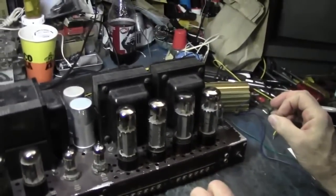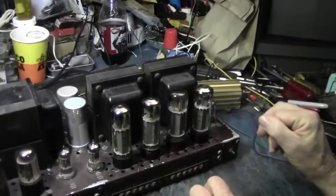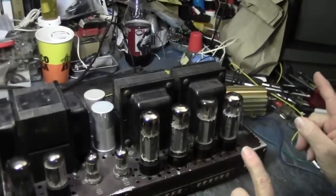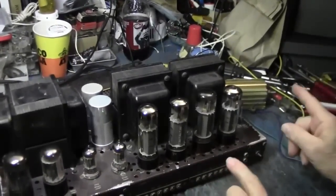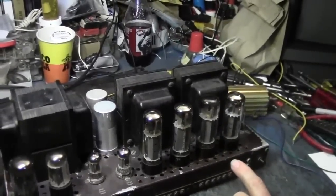Okay, now let's say the simple stuff. What class amplifier is this? It's class B. Okay. Yeah. It does have a cathode resistor, which most class Bs do not. They're cathode straight to ground. But this one has a damping factor feedback circuit. So there's a cathode resistor and capacitor.